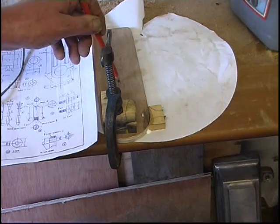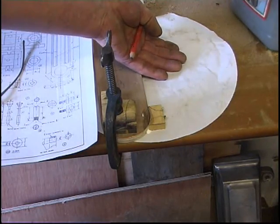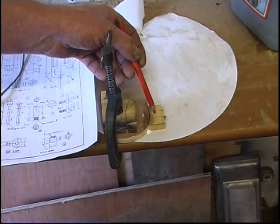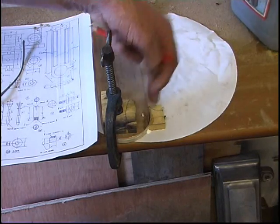So all I've done is clamped this to the bench. I've used one of the backing sheets off my 12-inch disc sander — that's what comes to protect the glue on the sanding discs. The glue won't stick to that. I've sanded a bit of wood to shape, glued it on, and just held it in place with two pins. It doesn't need a physical fastening onto there.